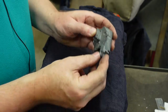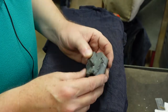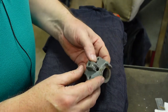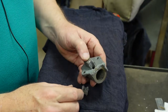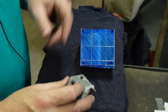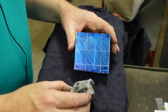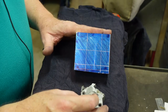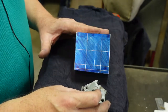And that's all I've got. There's a little bit missing off here and here. So I guess to start with, when doing something like this, you need to measure up and make sure you've got a bit of material that will suit. I've got a piece here and I've started marking it up. This is just a chunk of aluminium I had sitting around the place - it'll do quite nicely to replace the zinc. The nice thing about aluminium too is if later on it needs to be repaired or worn a bit, I can weld that. Whereas the zinc, it's basically a throwaway part.